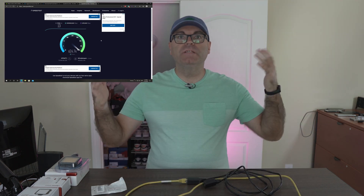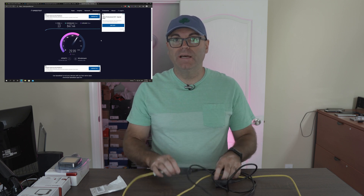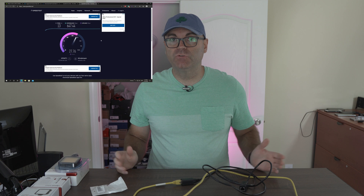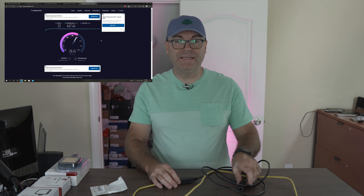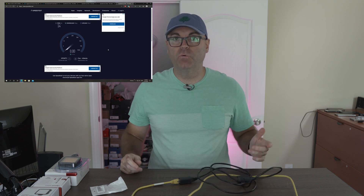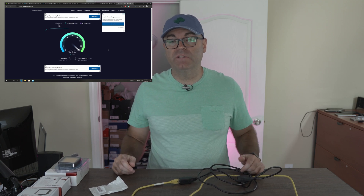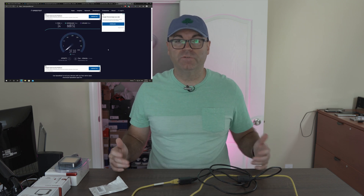As you can see from the tests, our speed is not affected at all, even with adding a second coupler between three cables. First thing I tested was no couplers at all — cable directly to the router — and the speed is consistent with no problem. The second test was adding one coupler between two cables, again router to the RJ45 on the back of the desktop — pretty much the exact same speed, no effect at all. It's actually slightly higher, but the speed varies up and down depending on what people are doing around the house and on the internet, so that's not affected by the coupler at all.